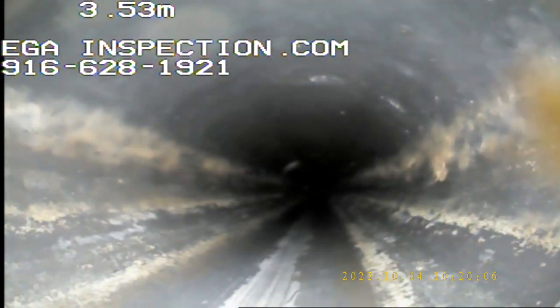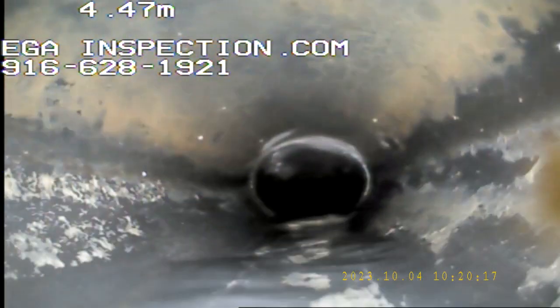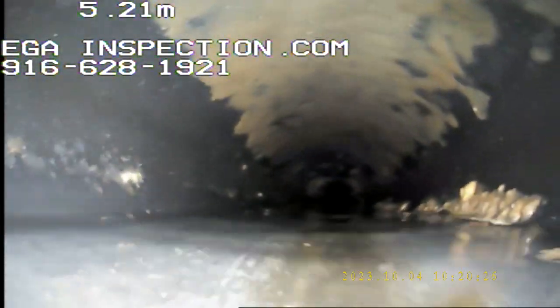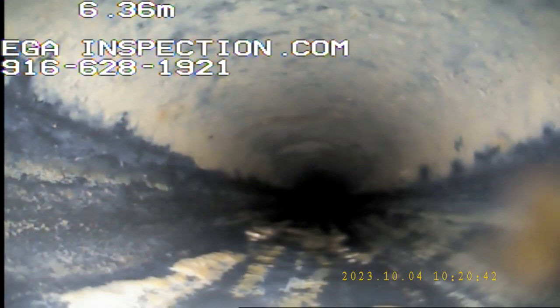We'll see if we get to the vent. That's probably going to make a 90-degree straight up vent out of the pipe under here. The inspection's done — we've already flooded the system with all the sink water, toilet showers, all that. Found normal issues we always find. This water we're seeing right here, my camera is literally about a quarter inch off the bottom of the pipe. A little bit of water isn't uncommon, just as long as it's flowing. We've got a little bit of sludge and a little bit of debris in the pipe.